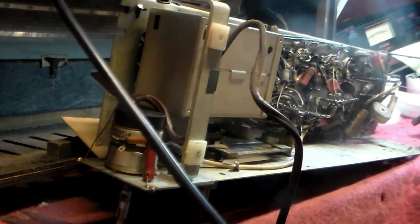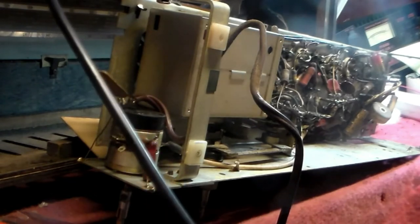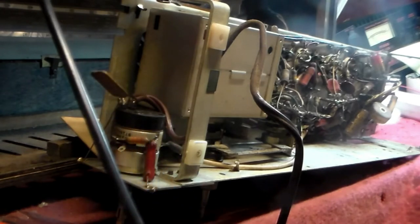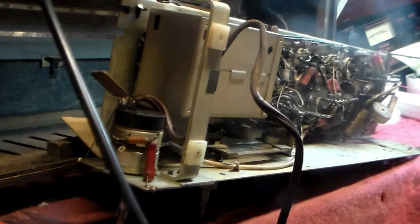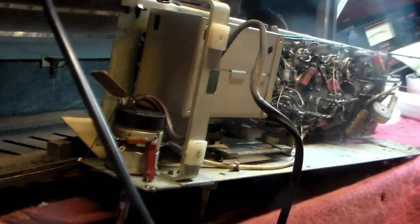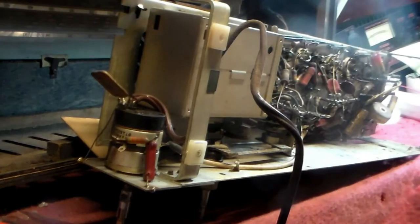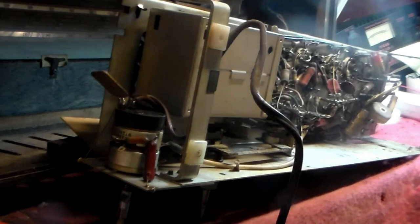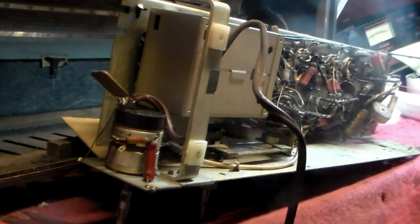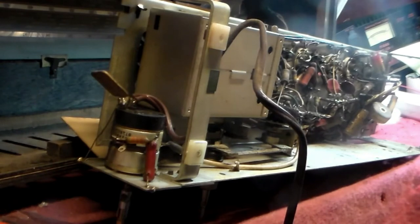Switch it on. Get the plug, which is here, which I've checked by the way, it's okay wiring wise. I also checked that this one is legal, of course, some aren't. And look, you see that one, see the live doesn't go to chassis, but the neutral does. So that is okay. If it's the other way around, take the plug apart and swap the two over. At the end of it, it might be worth changing the cable as well, because this stuff is technically illegal for sets, so it's wise to change it, particularly if the cable itself is frayed, which this one isn't. But that's okay.